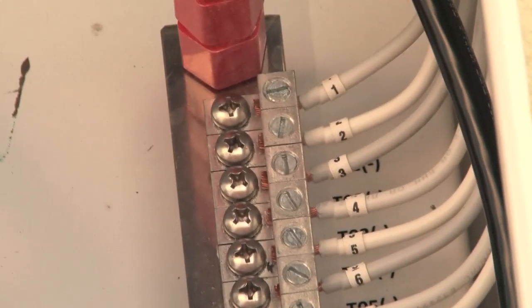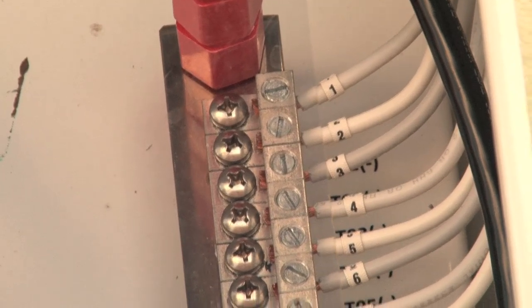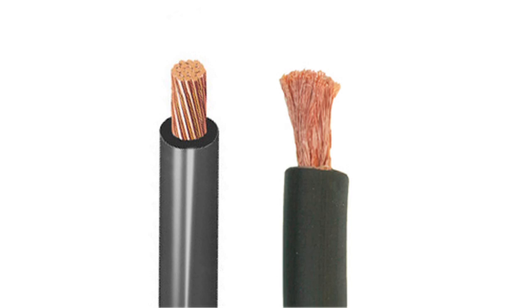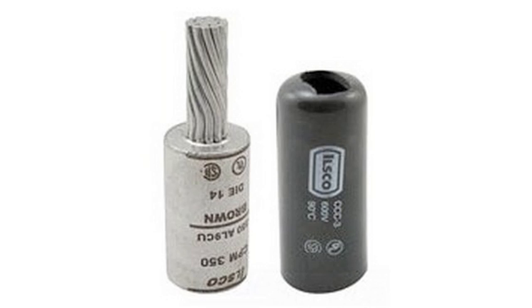In a PV system there are two types of stranded conductors. There's a coarse-strand and a fine-stranded conductor. The coarse-stranded conductor is what we have here in this enclosure. Almost all lugs are rated for coarse-stranded conductors. From these pictures we can see a fine-stranded wire and a coarse-stranded wire. A coarse-stranded wire — no problem, we can land that right on the terminal. But if we've got a fine-stranded wire, you're going to have to install a rod extension crimp onto the fine-stranded wire, and then the rod extension would be terminated into the lug.